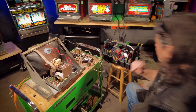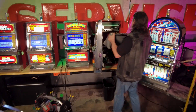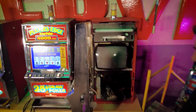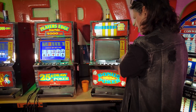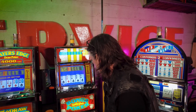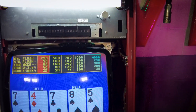I'm not going to discharge the monitor this time — I'm just not going to touch it, not putting my fingers anywhere near the back or close to any electronics. I'll set this into the cabinet. That feels solid. I'll connect the Molex from underneath, and the moment of truth is to hit the power. It works. We may need some minor adjustments — I see a lot of discoloration in the top corner of the monitor. Sometimes I can get this out with a tool called a degausser, so let's give that a try.